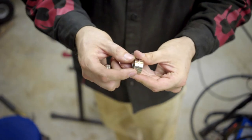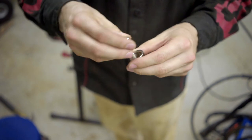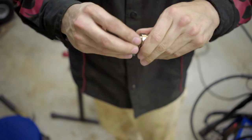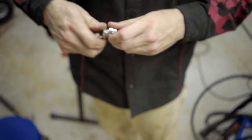I'm using O2 bungs that are stepped — see if I can get this to focus. There we are. You kind of got a groove in here to work your bead so your bead doesn't get too fat. Then I've got nice plugs that'll go in there. I'll throw a little gasket material on there, but it should seal up pretty good once it's all said and done. They tighten down with a hex key, which is nice.